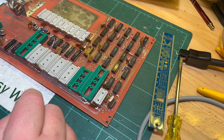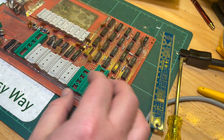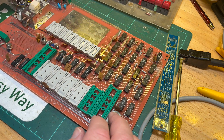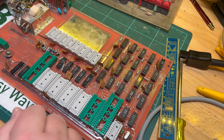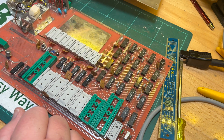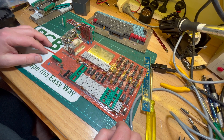I think I'm going to try a minimal configuration to start - not going to connect up the expansion bus, just have the main keyboard. Actually you can boot it up without the ROM module and it'll boot into a monitor because the monitor ROM is on here, so you don't need BASIC to boot it. So the main board and a keyboard is the basics - I'll try that probably on Friday when I get back home. That's it for now, bye!